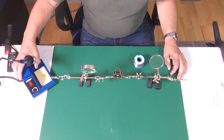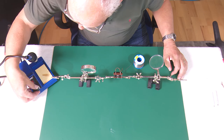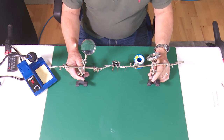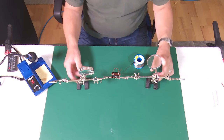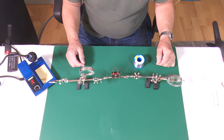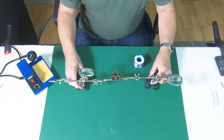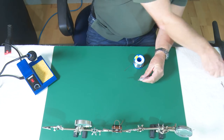Here's the soldering iron. I've set it to kind of the two o'clock position — so it's about two-thirds of the way up. I have two helping hands here; if you haven't got any of these I'll leave a link in the description — they are so useful especially for soldering because they can hold the object in place. I've wetted the sponge, turning on the soldering iron now — you can see it's glowing red. While that's warming up I'll show you the other tips in close-up.